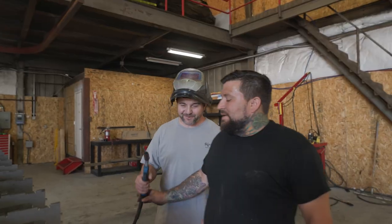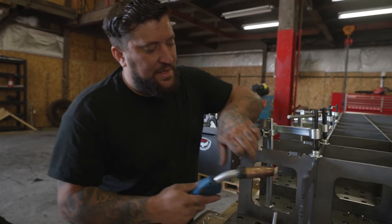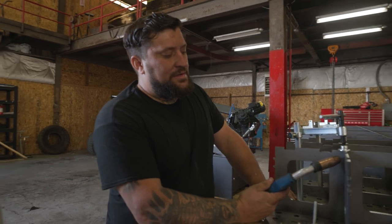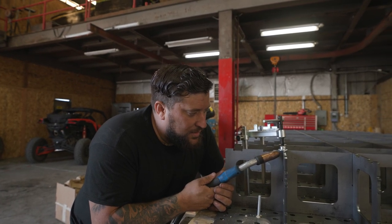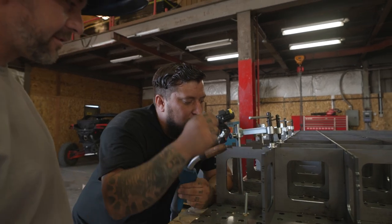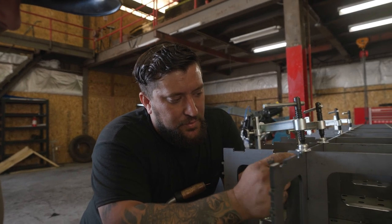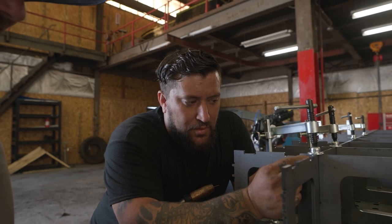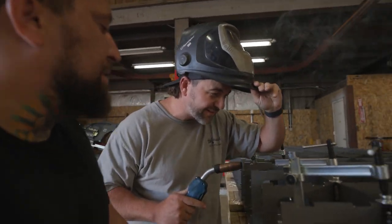You're gonna have to start somewhere else, then just go slow on something like this. Go completely perpendicular to the weld joint - so your weld joint is essentially 45 degrees off of each of these, right? Don't hold your gun like this, don't hold your gun like this - right there, perpendicular to your weld joint - and just run it down. Work it into the weld joint and you can slowly start feeling out your puddle manipulation. Your biggest thing is to stay right there in the root, and then to be able to watch the toes - each end wet into this material. You'll see it in the hood, you'll see it grow, and then you can slowly move and just let it grow.